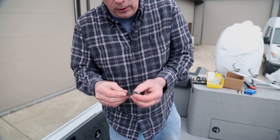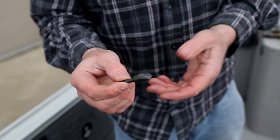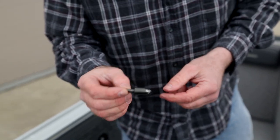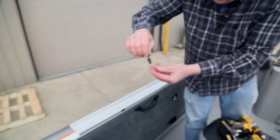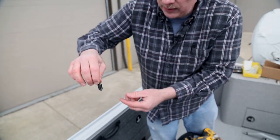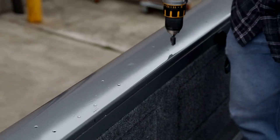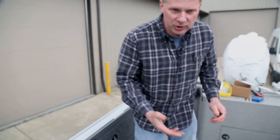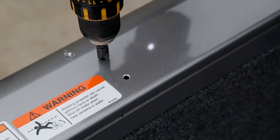I tell a lot of guys about a chamfer tool — this happens to be an 82-degree countersink tool. They make them in 80 and 90 degrees; I don't care too much about the exact degree. This is a chamfer tool, single flute. You put this in the top of the hole and it spins, putting a little chamfer right on the top of the hole so there's no burr sitting between our aluminum gunnel wall and the bottom of our track, so that track is sitting down nice and flat. These are just a couple of the tools of the trade you'll need to make your job a lot easier when you go to set up and install your track.